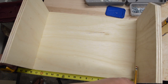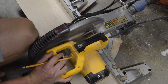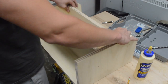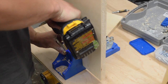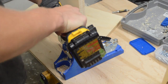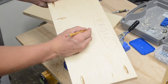I purposely made the length greater than 16 inches so that I could drive screws on the center of the studs behind the drywall in my shop. I decided to go with two shelves here because I wanted to store some sandpaper and other miscellaneous things — you can obviously change it however you'd like. I always end up labeling the front so I don't turn things around during the assembly process. It helps keep me straight.